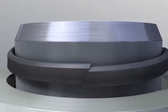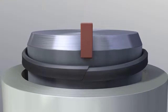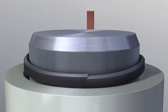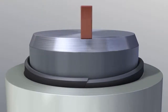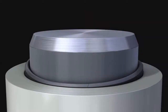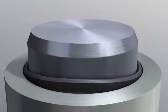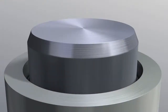During mounting, each ring is inserted into the housing individually with a butt joint first. Then you should press on the point opposite the butt joint in such a way that the loop resulting from the over length will lie evenly over the entire circumference of the seal ring. This will ensure that the seal ring can be pressed relatively easily into the housing despite the over length of the seal. Should a loop be formed over a short distance only, assembly will be much more difficult.